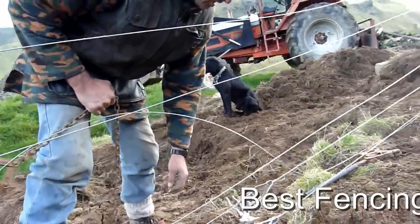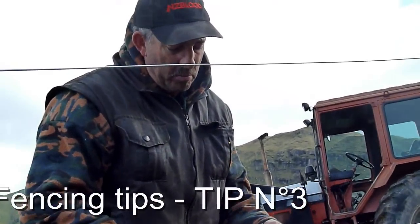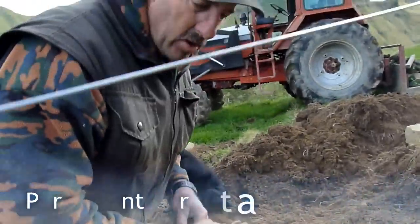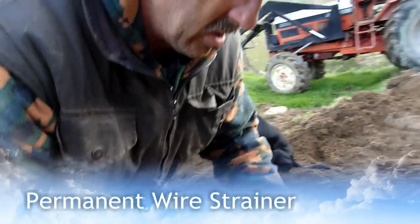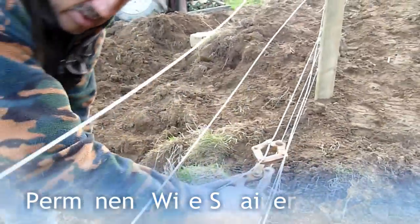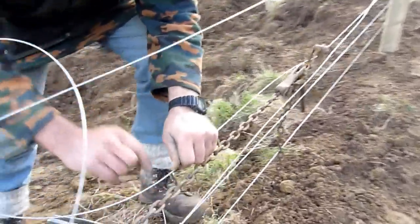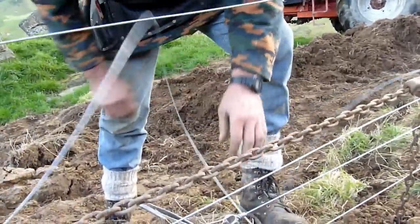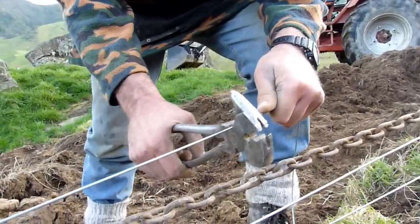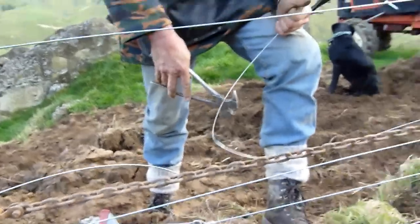This is what I consider the proper technique for putting on permanent wire strainers, and it's a technique that I've perfected for years. I'm putting a bend in just above where I wrapped this last wire off, on the end of my thumb. Then I'm cutting it just over that wrap again — that end bit might flick on you. Cut off about a foot of wire.